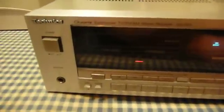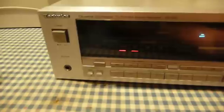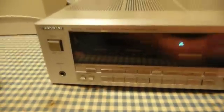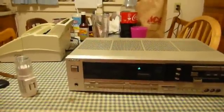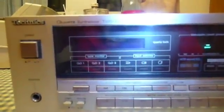For example, there's tape one monitor. This thing has no less than three tape monitors on it, which I cannot imagine why, but it does. Not all the indicators on the front work the way they should, and I've been in there far enough to confirm those are due to bad solder, just like the equalizer had. But the station display never lights up. Now, it does tune stations — it was listed as being able to do that — but you can't see it. This is one of those liquid crystal displays with a colored filter and a backlight, and the backlight bulb has given up. If I shine a light just the right way, you can just faintly make out the numbers.